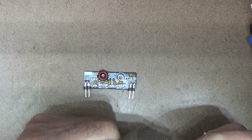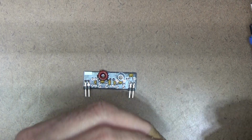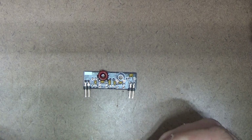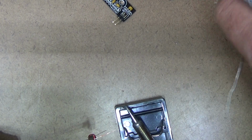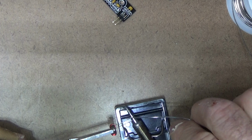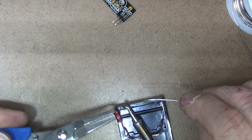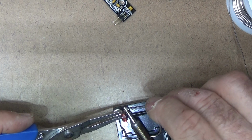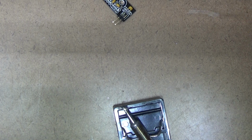This is going to go straight out of the thing, and I see bare copper all around. This is going to wrap around the final wrap, and I can see nice bare copper. Okay, time to tin the leads again. I'm going to get my pliers with a gentle grip. I'm going to try to grab it up there where there's no. Whoops. Okay, so I can bring my soldering iron in, bring my solder in. Looks pretty good to me. I'll wait for that to cool down for a second.